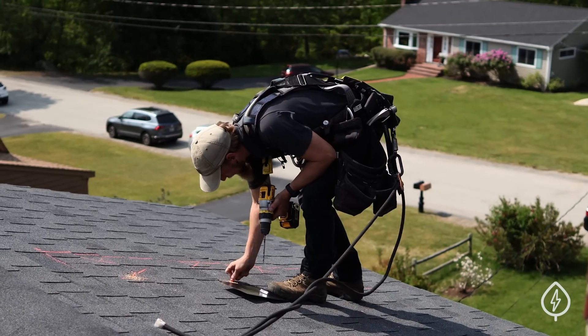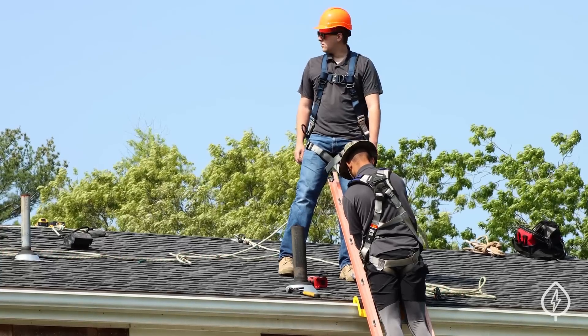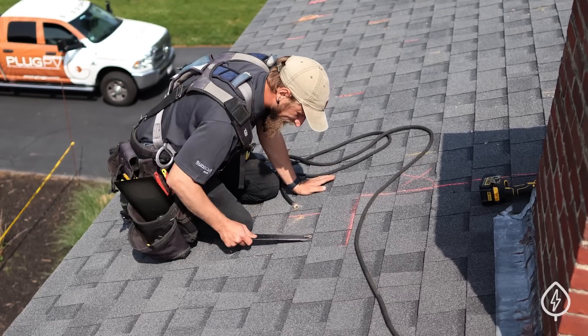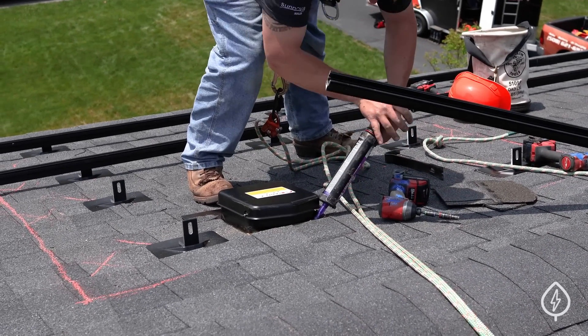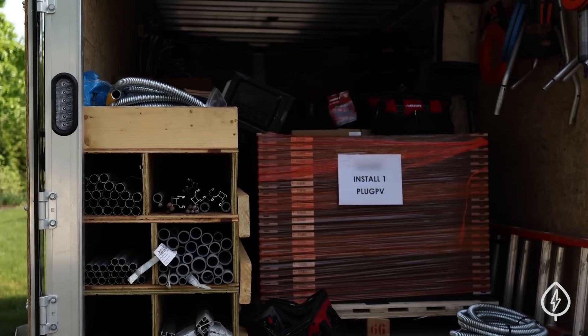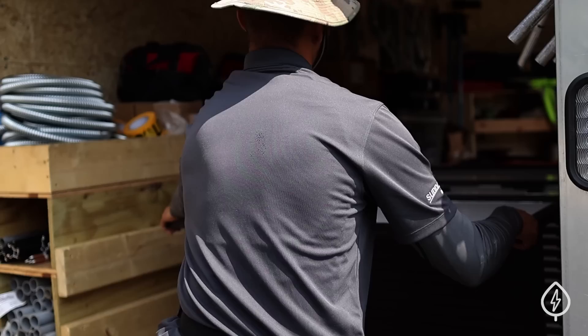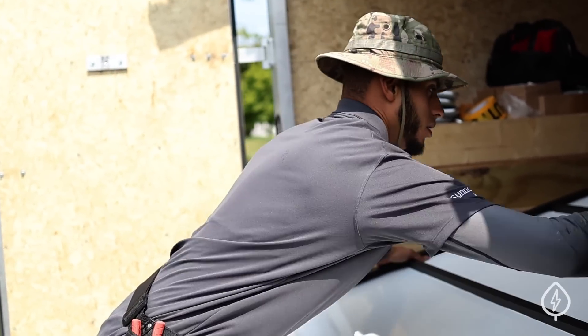90-plus percent of the roofs that we install on are going to be comp shingle. Other areas of the country we do see tile and other alternative forms of roofing materials, but the vast majority are in that comp shingle category. With that, we're looking for a mounting solution that essentially conforms to that shingle contour the right way, laps with that shingle and sheds water the right way. From there, we're looking for strength and reliability in our rail up over that mount, and then something user-friendly, easy to install for our guys. Everything you put on the roof at a solar installation like this has been specifically designed for coordination with roofing companies, manufacturers, and that racking manufacturer to fit that roof.